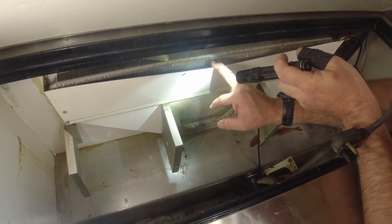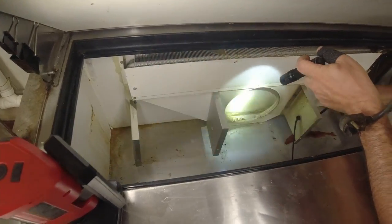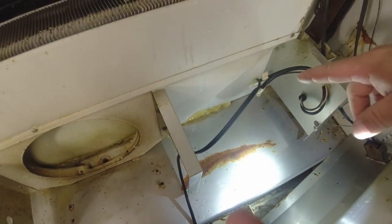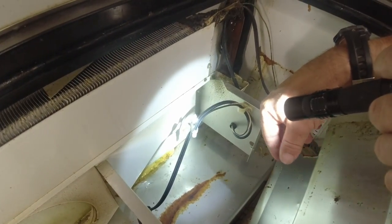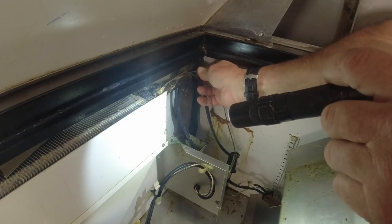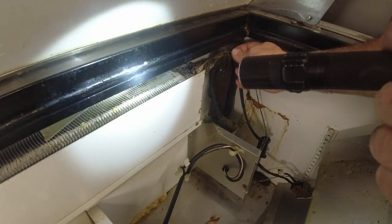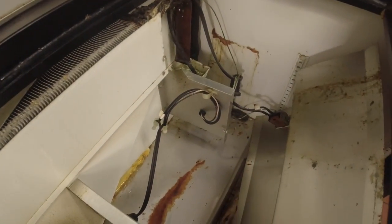What we could do is get our pump sprayer out, spray some water on it, and see if we've got any leakage coming out along this side or possibly over here. That insulation right there - I don't know if that's factory or somebody jerry-rigged something to try to keep it from doing it before. Also I'm wondering if this thermostat is all the way in - it's kind of loose. Maybe the thermostat has issues and it's never shutting off, which is why it's freezing up.